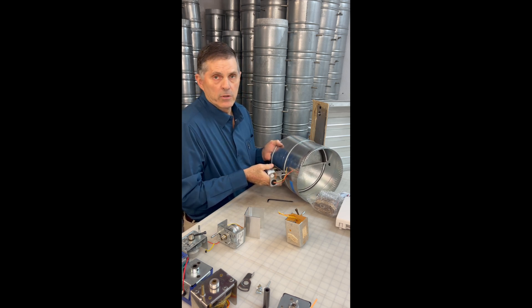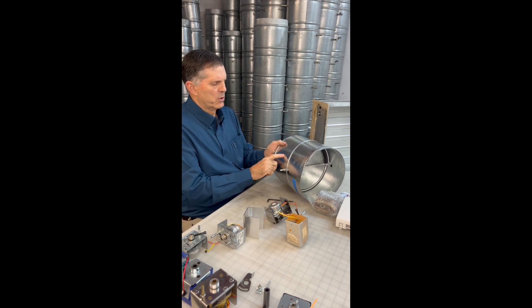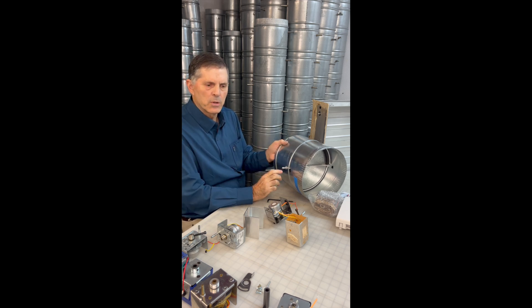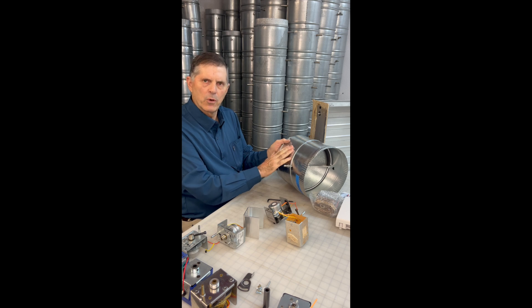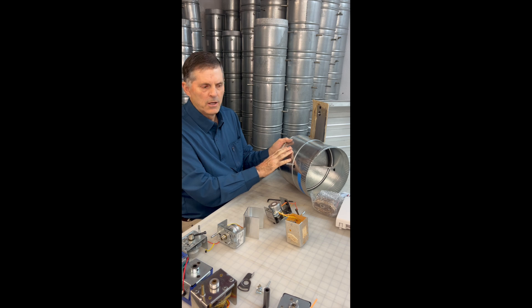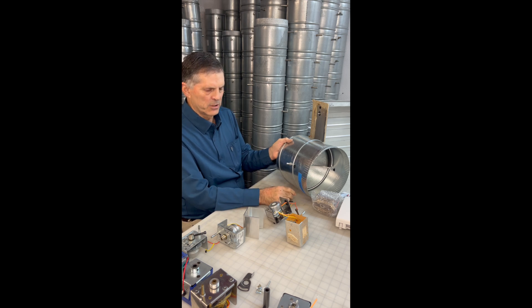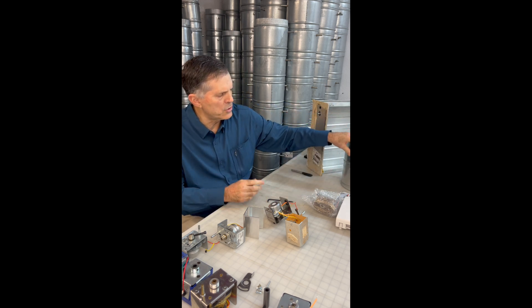You could also drill holes to look inside, disconnect ducts, or use other methods, but they're usually not necessary. These are all very low pressure duct systems, and with foil tape you can easily seal an access hole or visual port. Don't be afraid — it's not like drilling into plumbing. This air is operating at a fraction of a PSI and it's very easy to seal up.